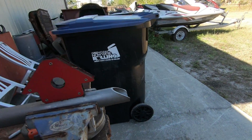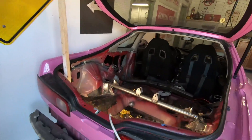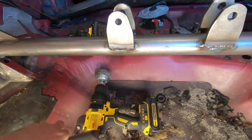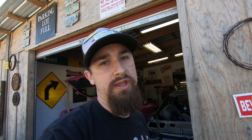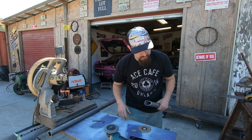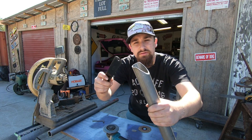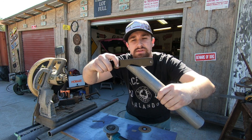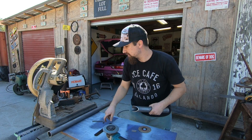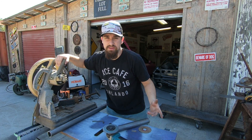One of these bars is going to be going right here, downward, and I've got some base plates that I'm going to put here and here so that it's going to be nice and strong. The first cut I'm going to make is actually sharper than 45 degrees, because in the end you want from this point to this edge to be 45 degrees — meaning this initial cut is going to be not 45 degrees. So I'm going to put it in here and make that first cut.